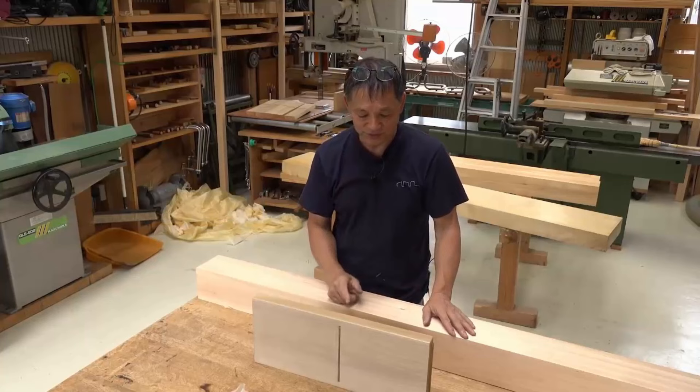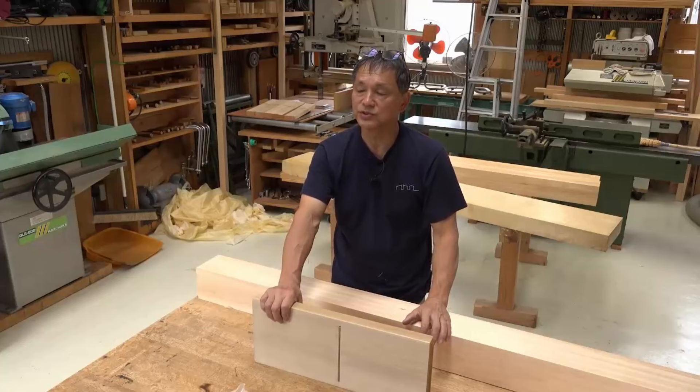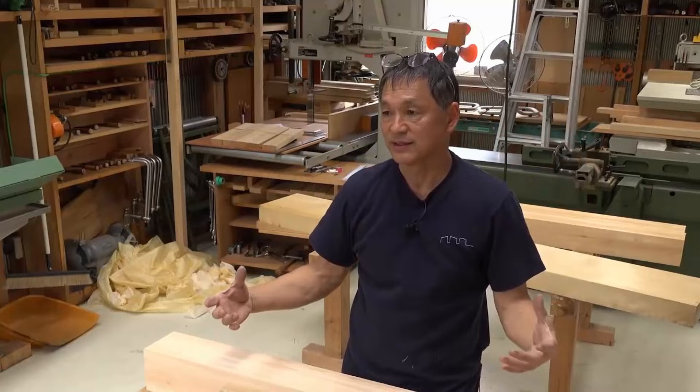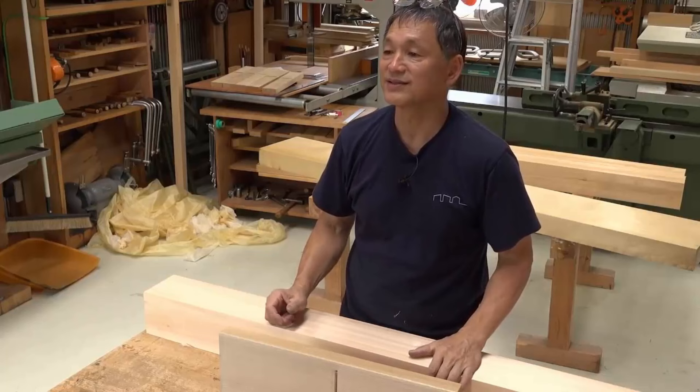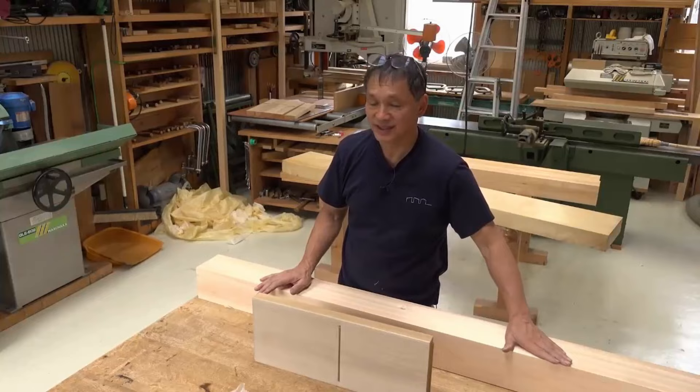This plane isn't too difficult to use. It's about twice the size of a standard sunpachi-sized 72 mm wide plane, but sharpening it isn't too complicated. I use it for thresholds, head jambs, or framing members. Even with such members, if it's wider than 180 mm you can't plane it in a single pass. However, this will work for larger posts of about 120 mm — I can plane the surface in a single pass, so it'll produce an immaculate finish.